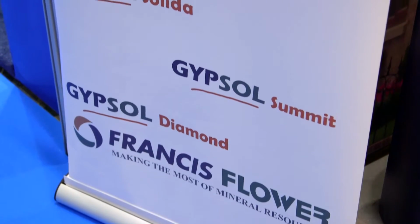The other system that we promote quite heavily is a system which is geared specifically for underfloor heating. Underfloor heating is becoming more and more popular these days, and people want to get the system as efficient as possible. The way to keep a system efficient is to use low flow temperatures and fast response. So we've developed a system called HTC, which stands for high thermal conductivity, and that has a much higher thermal conductivity than a traditional sand cement screed, typically just over twice as conductive. So that makes it much more efficient when it comes to using underfloor heating. Well, that's 3 of the systems that we've got available.